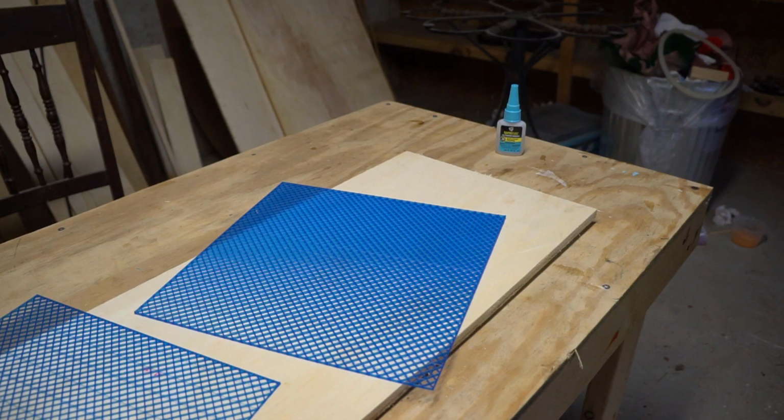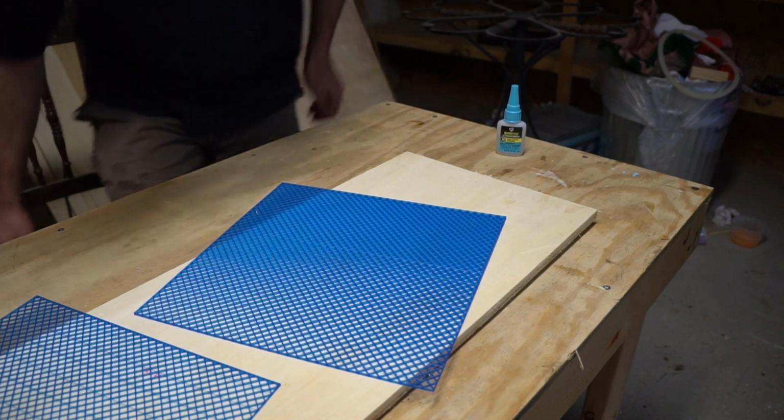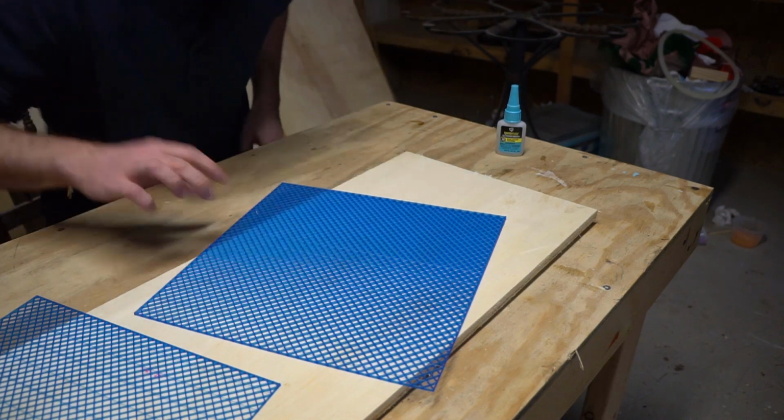And I wasn't sure that any of the tools that I had in the shop were capable of making a 3 millimeter, 4 millimeter stock removal over however long the distance of my nose was. But my 3D printer might be. So I made these. These are printed panels that give me the very subtle wedges for the cradle that I want to use to profile my nose and tail tapers.